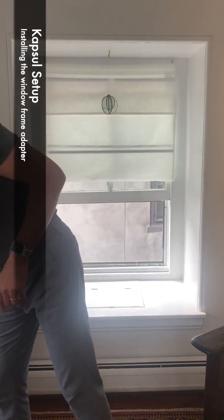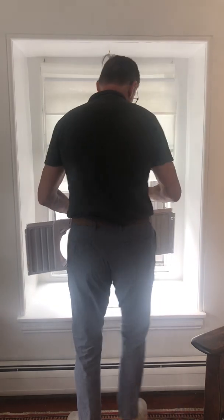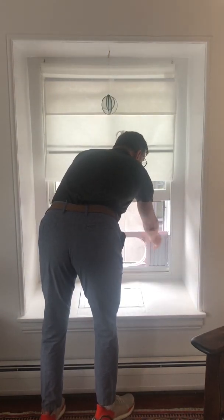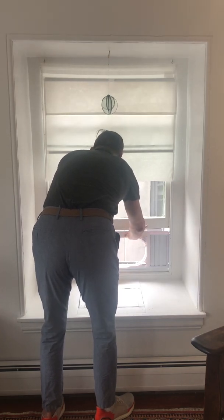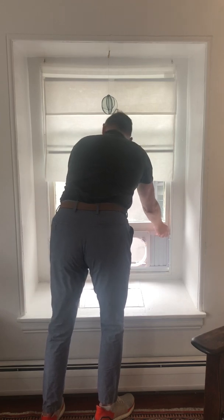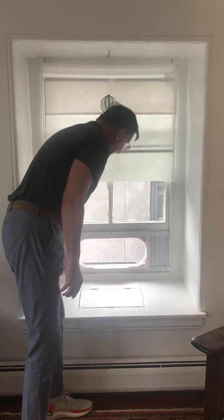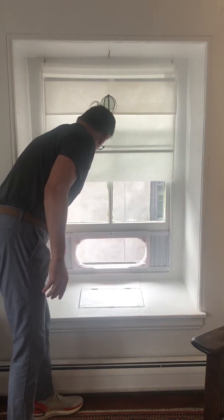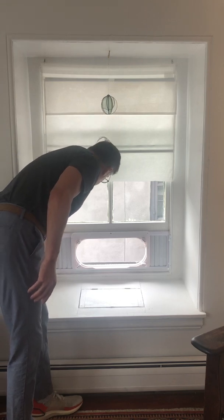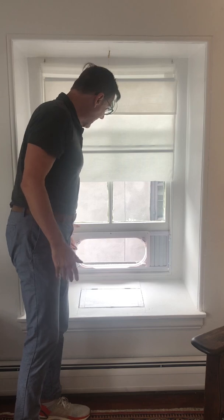Now we take the window frame adapter. As it's assembled here, you want this on the bottom, and then we want to put it in the window. If I sized it correctly, it should fit pretty closely. I want to try to get it to center — I am dead on center. Now at this point, I just want to make sure I have a good tight fit, and I'm going to be putting some screws in. I don't need to pre-drill because this is very easy to screw into wood. There's going to be a screw here, a screw here, a screw here — those are very crucial — screws here and here, and then there'll be a screw on the bottom to hold it steady. That'll take about five minutes of manual screwing.